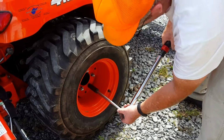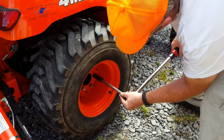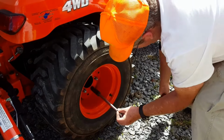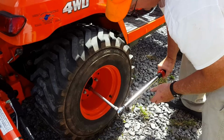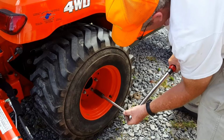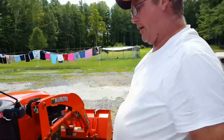That's why you should always torque them. Torque the impact. Don't always put them all the same, especially as the air pressure gets lower. And you go straight across as best you can in a pattern, in case you don't know. What I usually do is start around 12 o'clock and go around and make sure I got them all, just to make sure I didn't skip one somehow or another. Especially when I'm running my yo-yo. Get sidetracked. So there. That one's done.